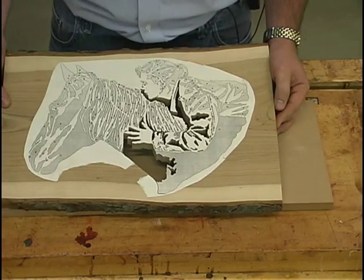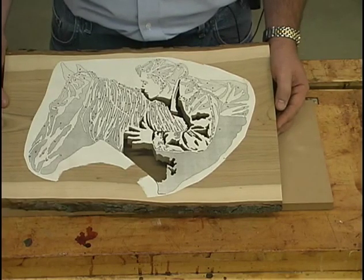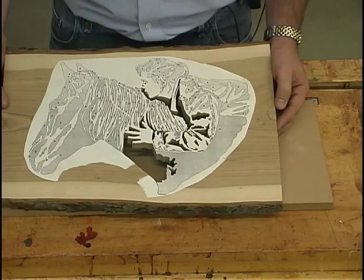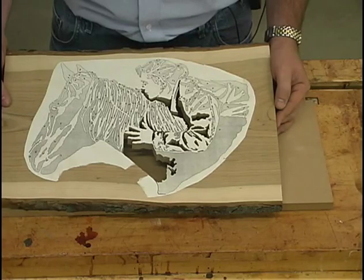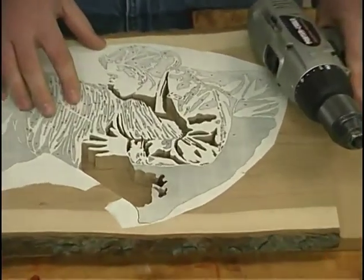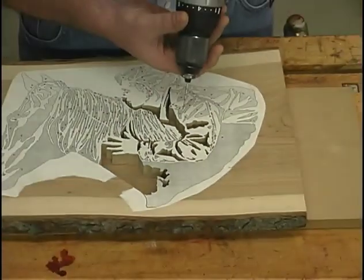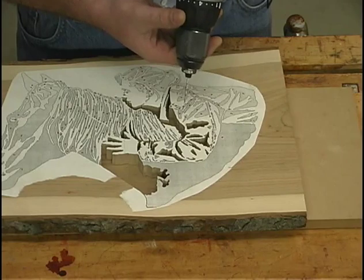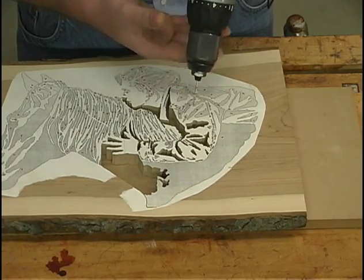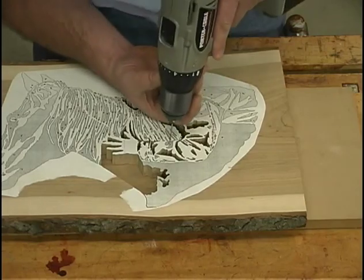The majority of my drilling is done just with a cordless or handheld drill. You can use a drill press depending on the throat depth, but some of the cuttings I've done are up to close to 30 inches wide, so I have to stick with the old-fashioned hand drill. When you're ready to start drilling, make all your red marks and identify where your holes are going to be drilled. There are different attachments for handheld drills to keep you drilling square — you want to drill your holes perpendicular, going straight down through the slab. If you get off on a slight angle, you may end up cutting out or missing an adjoining piece because the holes were drilled crookedly.